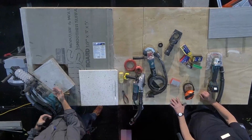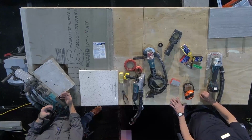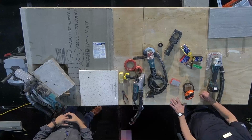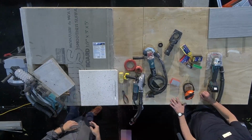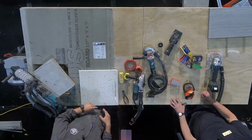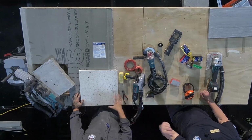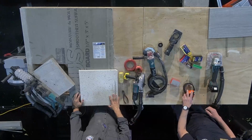So I like that the vacuum is also helping after that drill bit is removed. It's also sucking out that last little bit of dust, so that we can put a Tapcon or epoxy a bolt in that hole. Just occurred to me there's another benefit. I don't have to go back with the vacuum again and suck it out. Exactly. Yeah, that's great.